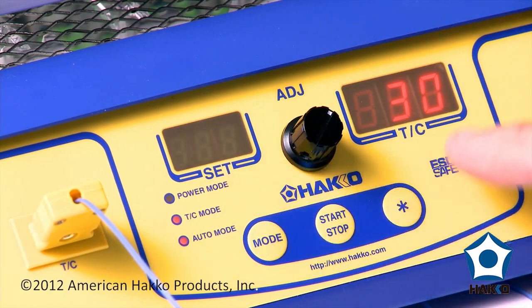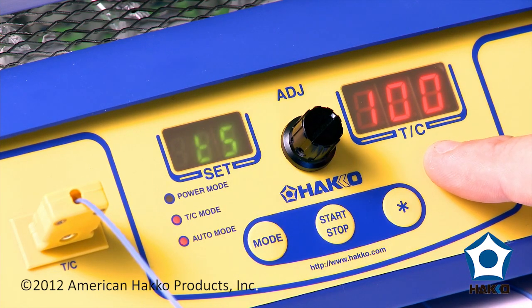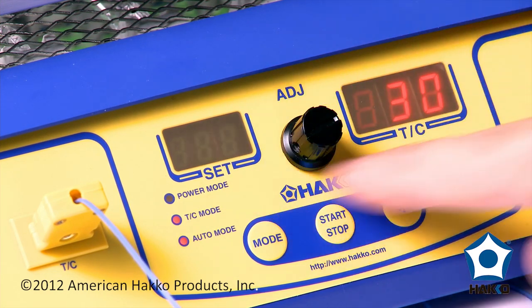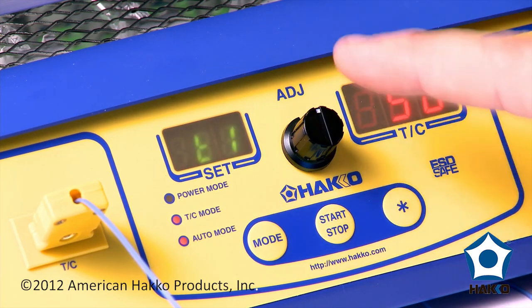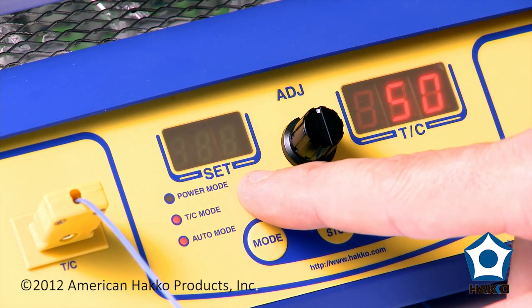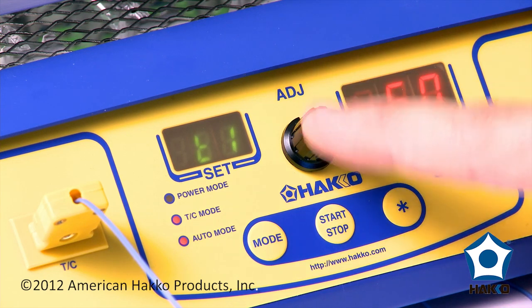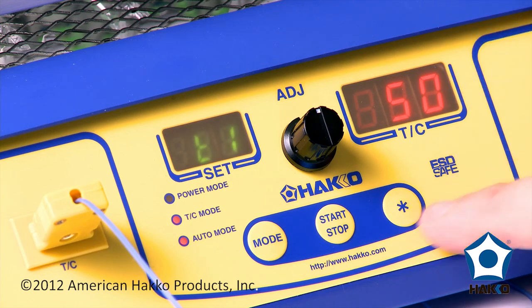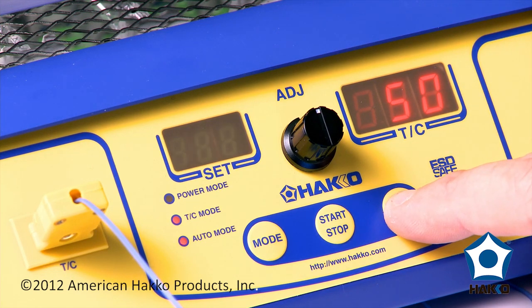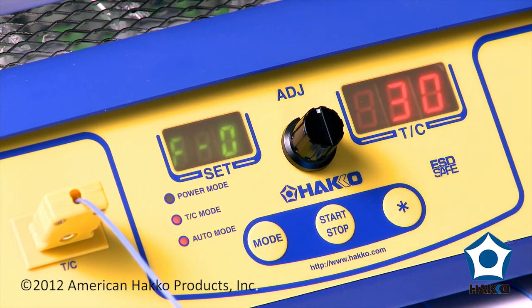The fourth part is time. The fifth part is my next temperature, which will end at 100°C. And my last part is a time of 30 seconds. I can change any of these at any point by turning the knob to adjust my setting point T1 through T6, and once I press enter I can use the knob to adjust the value. Once I've got that programmed, I hold the star button down and I'm asked if I want to store this. I acknowledge yes, and that's now programmed in to F0.